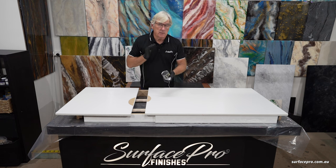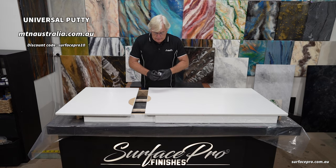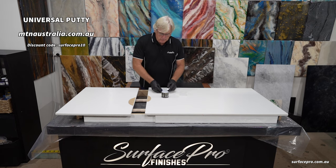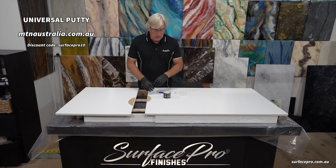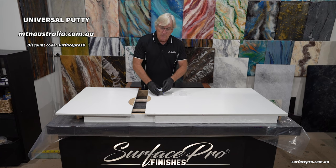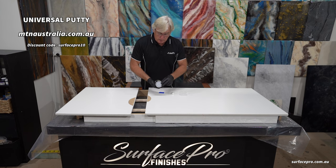Montana Australia make some excellent spray paints, which we use. And they also make their universal putty. And this is brilliant. It's very, very good putty, for filling joints like this that come away, holes in your countertop, holes in a vanity, holes in a kitchen tabletop, whatever. You can also use this product for creating a rock edge to make it look like split rock as well. Very, very good product, universal polyester putty.